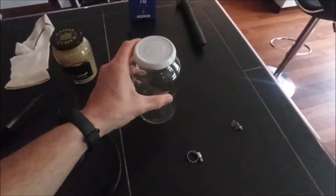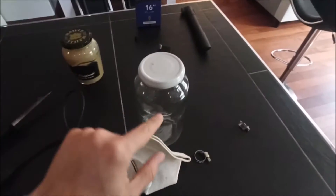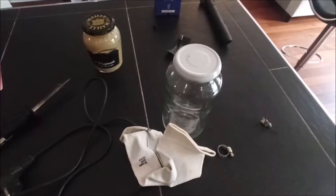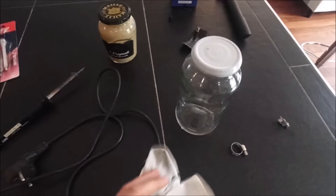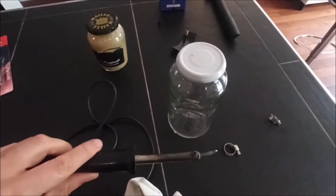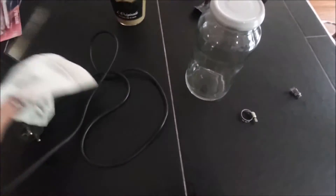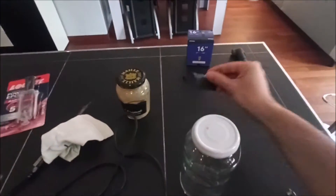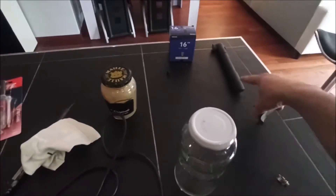So here's how it works. You have to put your socket inside the bottle. You will put some mineral oil — a specific one. Everyone uses baby oil; I don't know why, but buy this one. When the welding system heats up the socket, you will get smoke. So you have to blow air inside to have smoke getting out. That's why you will put the valve on the top here — you will blow with a pump.